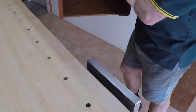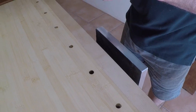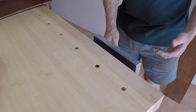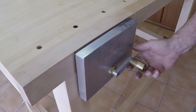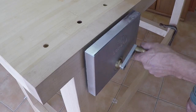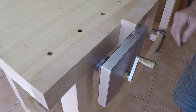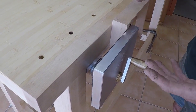The really nice thing about this design is we're relying on large surface area to hold your job with minimal force. That's why we only have a smaller handle, which makes it quick to wind the vice in and out — you don't need any more leverage than that to hold a piece of wood or a drawer, simply because we've got good surface area on both jaws. Non-racking is key: as soon as a vice racks you lose your surface area, which then requires more force, and sometimes that just makes it worse. So we've opted for precision over force.